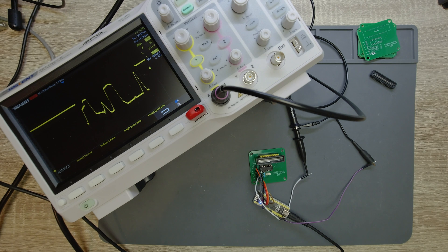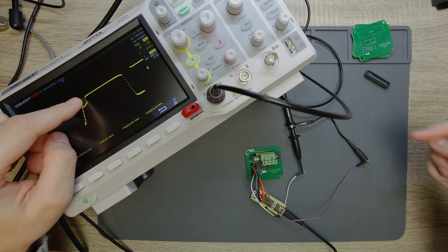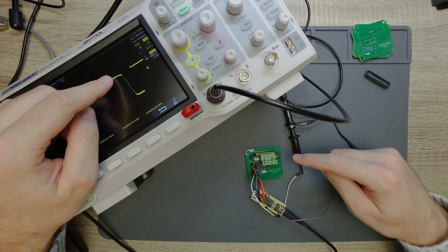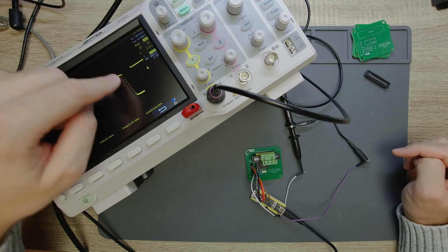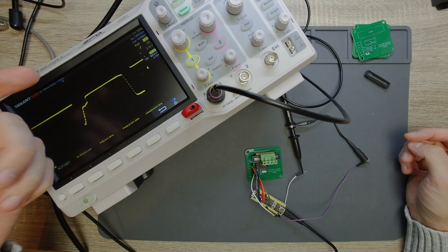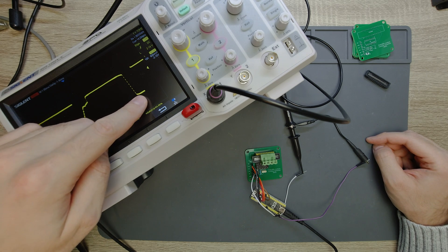I tried to find other objects nearby and placed a screw terminal on the CCD. Here we see a slope because the light is coming from one direction, casting a shadow over part of the CCD, causing the slope. The signal drops quite sharply on one side. Note the signal inversion: when the signal level is high we have dark pixels, and when the signal level is low we have bright pixels.